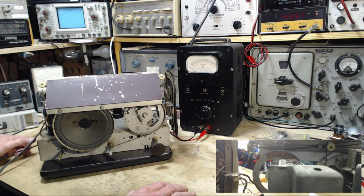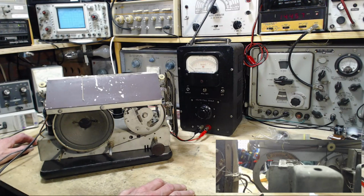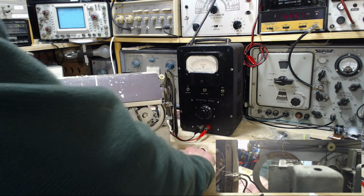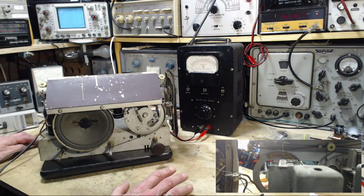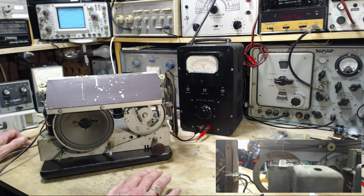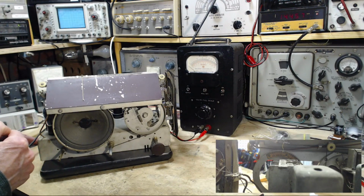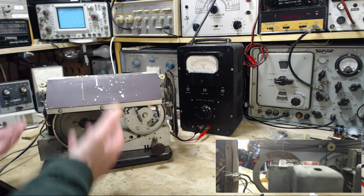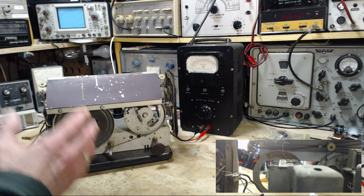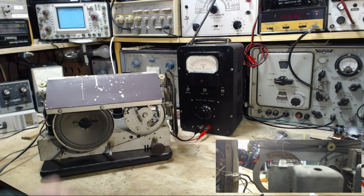Along with clamping the AVC voltage, another step that can be taken with these radios during alignment, when the time is right, is to knock out the local oscillator in the radio itself if you want, just to get rid of it. I don't do these things. Some alignment instructions are written on the basis that the radio is so far out of alignment that the only way you'll ever get it back is to carefully work your way from near the speaker back. But that's virtually never the case with these radios. They might be a little bit out of alignment, so some of the steps that might be recommended aren't necessary when you have a radio that's working already. Anyway, that's the end of that lecture.